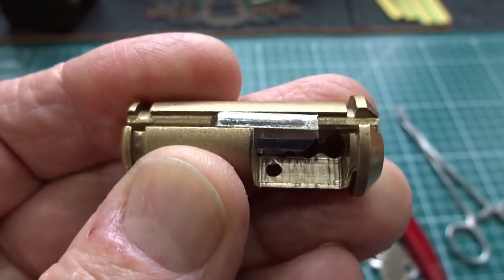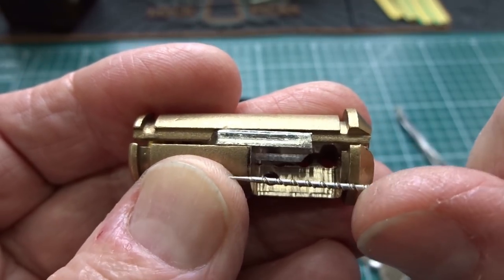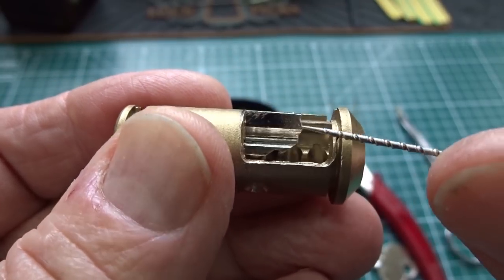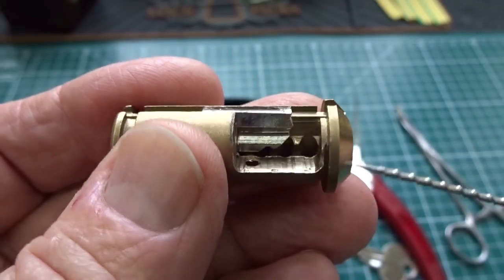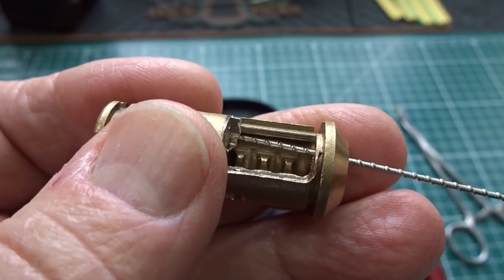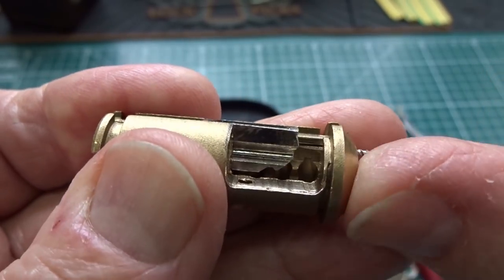Now it's going to quit right there because the side of this lock has been machined away. And it's starting to pull away a little bit. But I think you get the idea. But let's say that it only came out part of the way. And all you'd have to do is take your spiral extractor, take it in, and then re-thread it, and then start again, pulling the rest of the way.